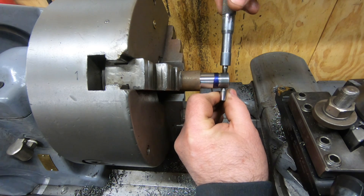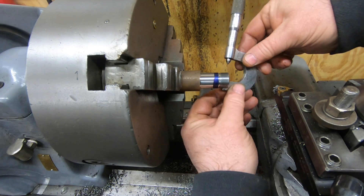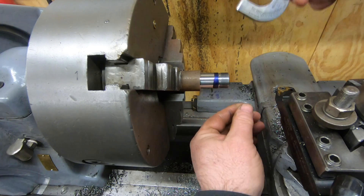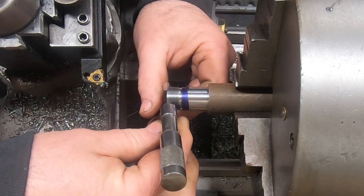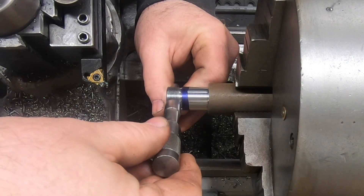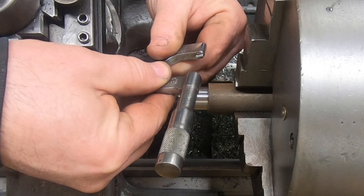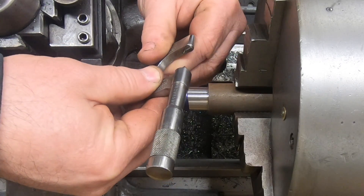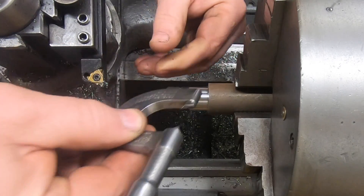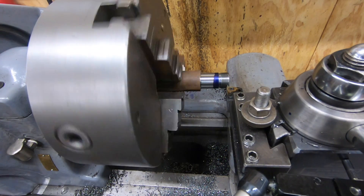On the fixed anvil it's actually a split V, so it fits over one of the threads. The opposite side is pointed and fits down into the valleys. The trick is making sure it's lined up true across from each other and not tilted to one side or the other, which will give you a bad reading. It's a little tricky with threads of this size getting it lined up just right, but I find this to be a heck of a lot easier than using the three-wire method.